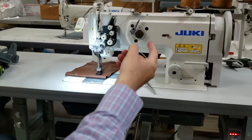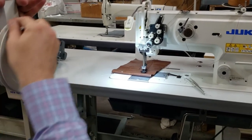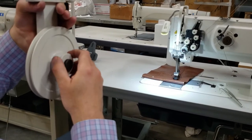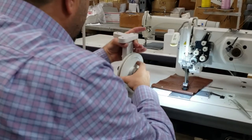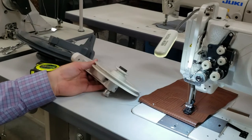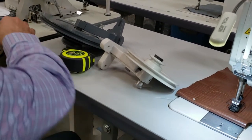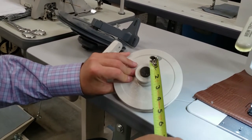The way it works: from the motor to the speed reducer, and from the speed reducer to the machine pulley. It makes it very slow — this large pulley has to make many turns to produce a small, tiny turn on the machine side. That's why they call it a speed reducer. You also need to buy an extra belt, usually size 25, 26, or 27.